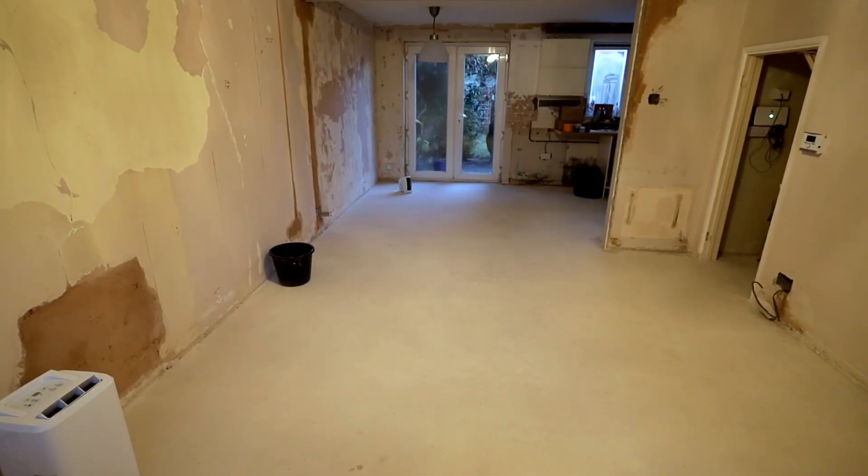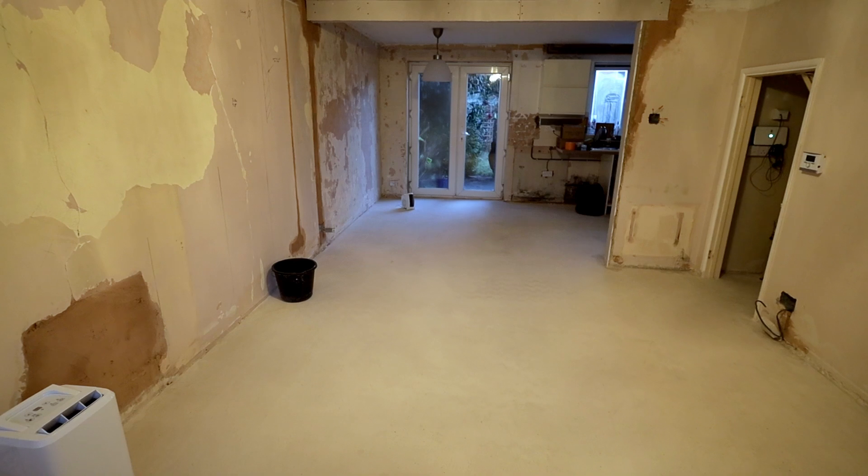The work has progressed. Now we've got walls ready for plastering and the flooring screeded and sanded down. They came back to remove the laitance - a film that forms on top of the screed that traps moisture. After the gypsum screed is done, they actually grind it down with a big grinding wheel rather than sand it.